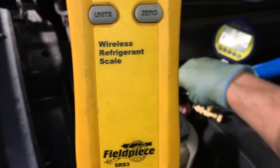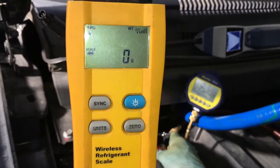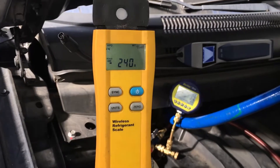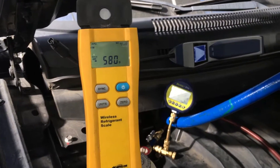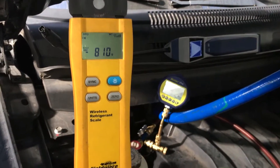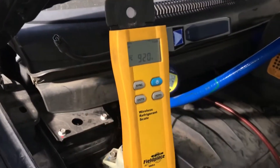Let's get that out of the way. Watch my fingers — I'm on the scale right here. And we're going in. We want 900 grams. When you do a nice complete vacuum, all your refrigerant goes in at one time, no problem at all. You're using all the gas laws to your benefit. Time to shut off — boom. It reads 910, 920 — a little will be left behind in the tube, and that was 907. I can live with that.